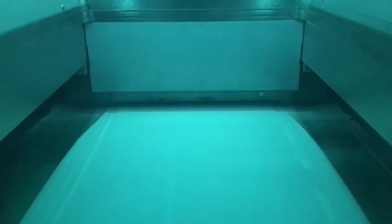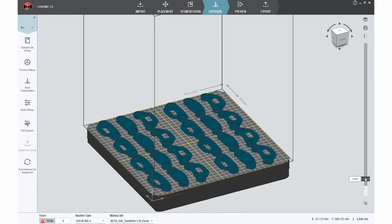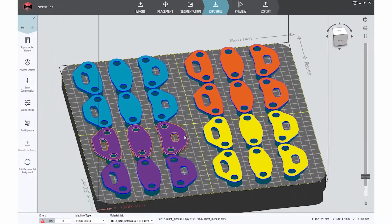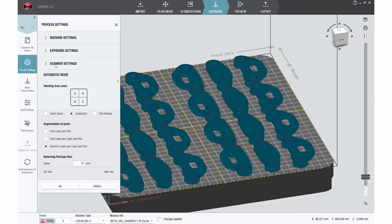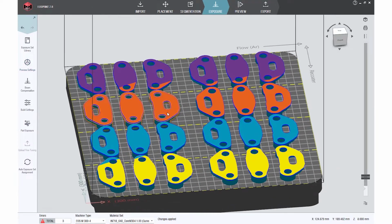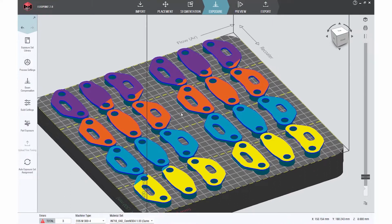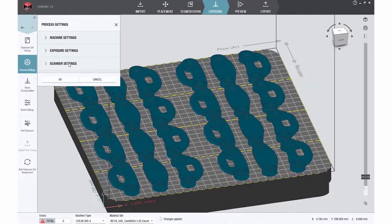the return movement. The 4 scanners offer the possibility of a full field use. This means each laser can reach any area on the build platform. This results in plenty of possibilities for intelligent assignment of laser to component. One possibility is the arrangement in a quadrant form. This means 4 equally sized squares across the build platform. Another possibility is the arrangement in narrow path, so-called swim lanes, in which the lasers operate.